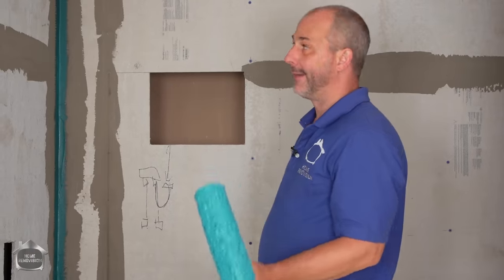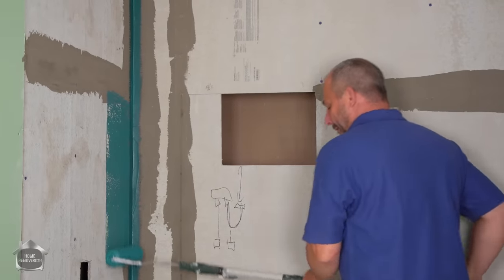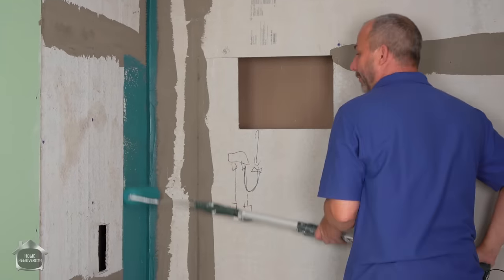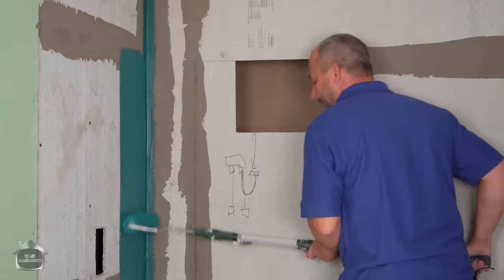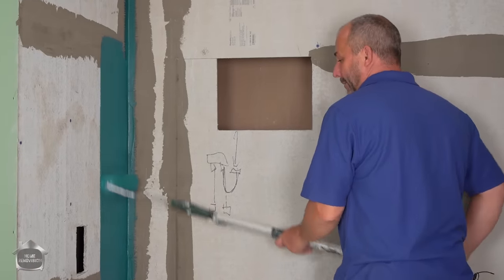Yeah. That's awesome. So depending on the design of your shower, if this is a steam shower, you want to waterproof all of the walls and the ceiling. This is just a regular shower. We're going to have a fan. So really, I could get away with just doing the bottom 4 feet with the waterproofing system, because the cement board doesn't get damaged if it gets a little bit of moisture in it,